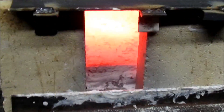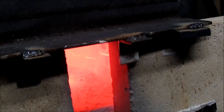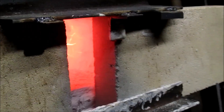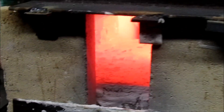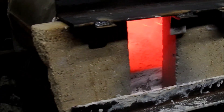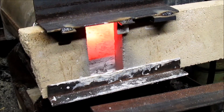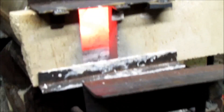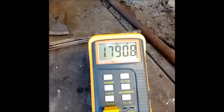I just turned it off after forging for a little bit. You can see a little crazing in there still, but I didn't notice any of the dusting off of the ceramic wool like I did the other day after that initial flaking of the kiln wash came off — that was it. The other day I was seeing a fair amount of wool dust coming out, so I'm happy with that. This is a video I posted on Instagram showing the internal temperature using my new thermometer and thermocouple. I got links to my Instagram on my about page if anyone's interested.